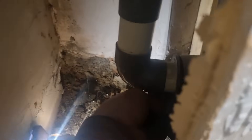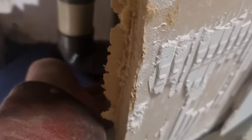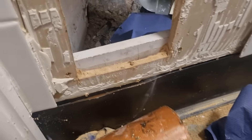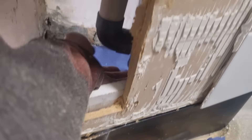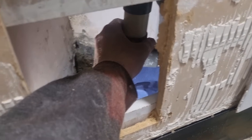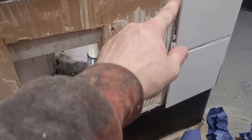I was as careful as I could be and it just pulled out. The rubber boss had pulled out, so all I've literally done is pushed it back in. I'm just running some water through it, but now I've got to re-tile this wall. I might put some CT1 on that boss so it doesn't pull out again. I don't think it will because it's nice and solid. I think that piece of soil pipe was in there wedging it before. I've just put some CT1 on the rubber - I know it's a little bit of a bodge but if it stops it pulling out, it should be alright.